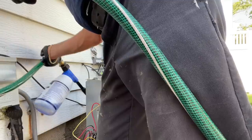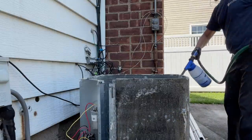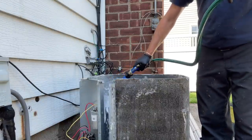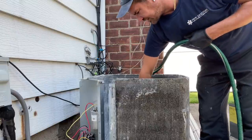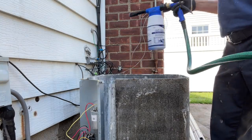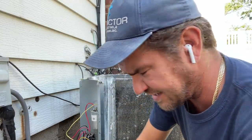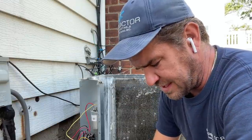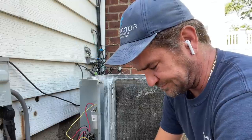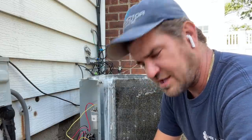Let's do a nice rinse on the outside as well. I don't want to push the dirt into the coil — I want to push it out. So I'm doing it on an angle with the spray, and whatever's left I'll concentrate on the house-facing side because that's where most of the dirt is — generally always the case. A lot of you asked in previous videos about the Viper Venom by Refrigeration Technologies — I love the Viper. At the beginning of the cooling season I bought cases of Blue Bright at Johnstone's pre-sale. I'm on my last case — about three gallons left — then I'll exclusively be using Viper by Refrigeration Technologies.